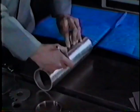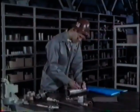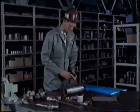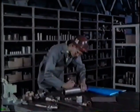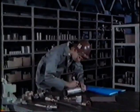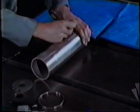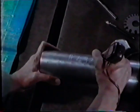Prepare the pipe first. Scribe on the main section of pipe the exact length of the pipe to be cut off. A vibro tool is good for marking. Never use die stamps or electric arcs. Use as light a marking as possible, since sharp grooves weaken the pipe. Transfer all data from the main section of pipe to the piece to be cut. Record, plan, and joint numbers.